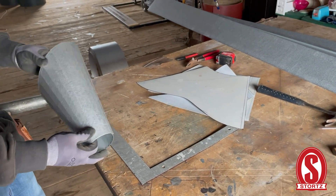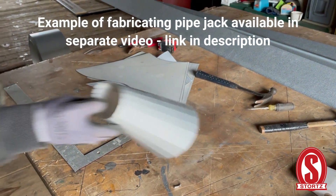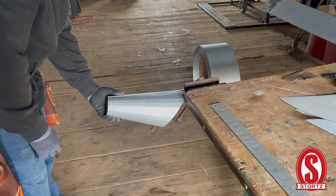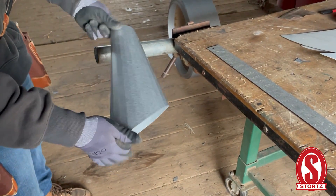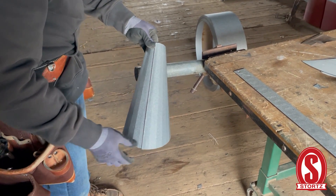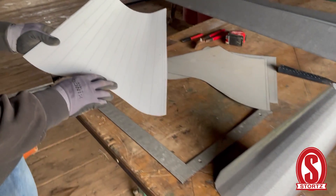Instead of making all these different bends, I did this because I like the look — it just looks custom made. It's not necessary; you can roll it on a piece of pipe like this. It's got a half lap lock on it, nothing fancy. When you put it together you'll use this pipe as an anvil, and I most always caulk the inside where the lock is to hold it together. You can take a swage or make some little dimples in it with a punch.